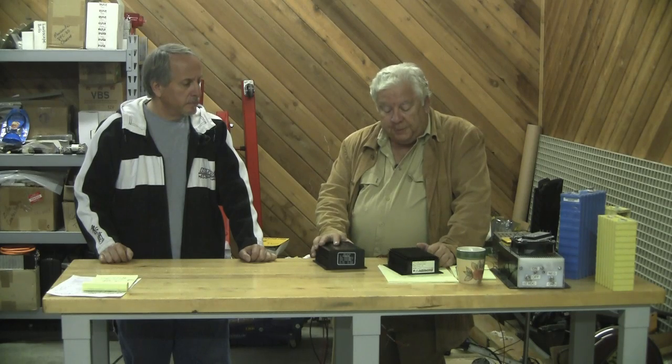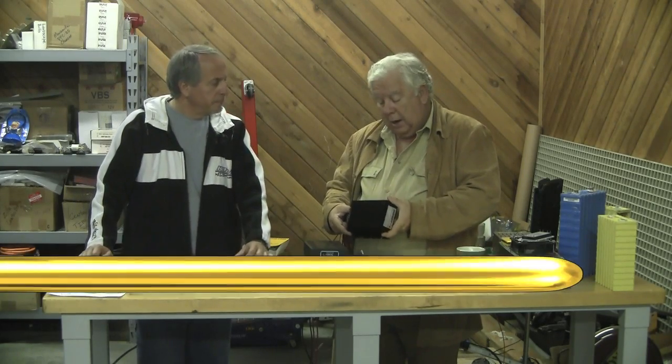For the Speedster they probably could work, but with limited accessories. We could go to a bigger one, or use two of them. The problem is a little motorcycle battery is a lot cheaper than these are. So you take one of these and a battery to use as a buffer — just a little AGM sealed motorcycle battery — put them together and you've got a 12-volt electrical system that'll work fine. You could use two of these if weight and size are an issue, and for some cars you might get away with one.